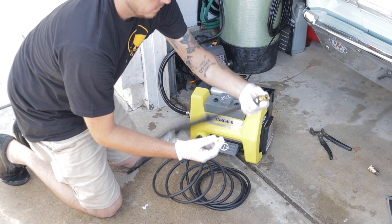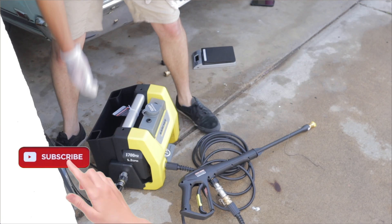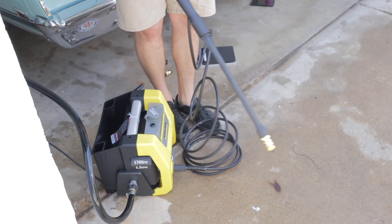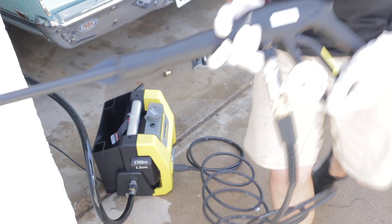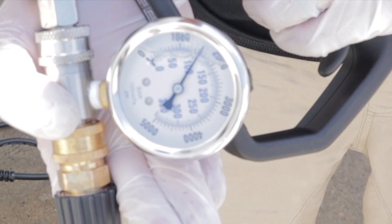Now just installing the 15-degree nozzle — that's what we'll be running our initial tests on, comparing the numbers they claim for PSI and gallon-per-minute with what we actually get. First, we fired up the water and it's good to see there are no leaks. It also has a total stop system, meaning once pressure builds the unit goes completely quiet until you pull the nozzle. With the 15-degree nozzle, I'm registering about 1,650 PSI — giving some variance for different gauges, I'd say that's pretty accurate to what they are stating.